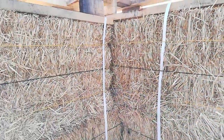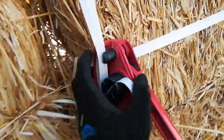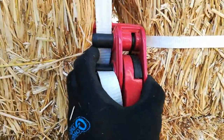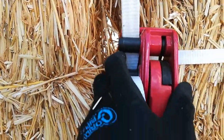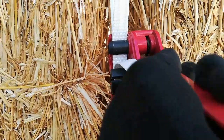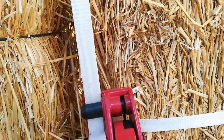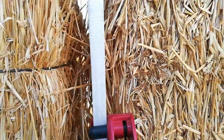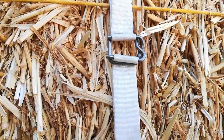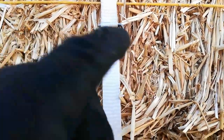It's working rather well. We're going to just continue. Using this ratchet, you just have to take your time and make sure that when you're using the ratchet tool, the webbing stays nice and even so that when you ratchet it, it doesn't want to slip to the outside. You want it to stay in that gear nice and even. Once it starts tightening down, you won't have to worry about it as much. Keep going slowly and keep an eye on that buckle — make sure that portion doesn't start to slip down, because as soon as it hits an angle, that webbing is going to want to slip off.